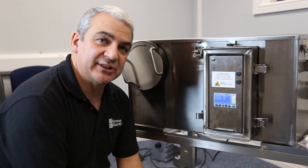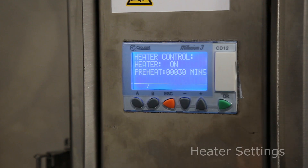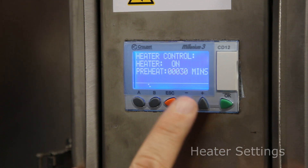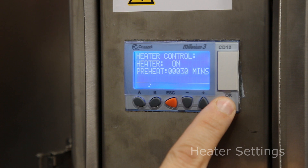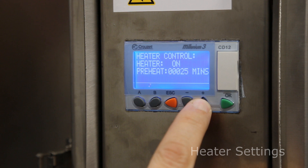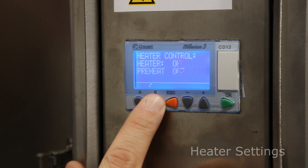The next menu controls the heater cycle. It is recommended that you keep the heater on for all skimming cycles. This menu allows you to control how long the unit heats for. If the waste is generally coming in cold you may want to increase the heating; however if the waste is always hot then you can decrease or turn off the heating. To control the heat duration, select the minutes by pressing OK and then increase or decrease your values by pressing plus or minus. To turn the heater off completely, just hold down your B button.